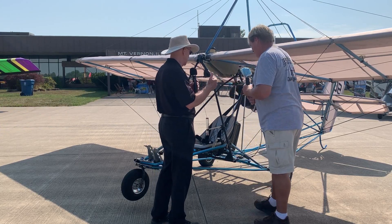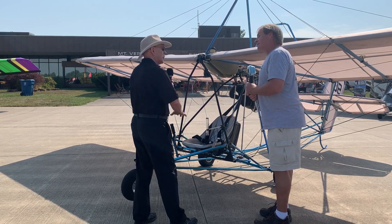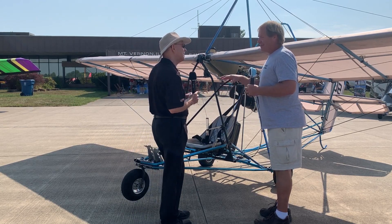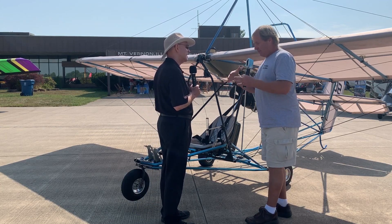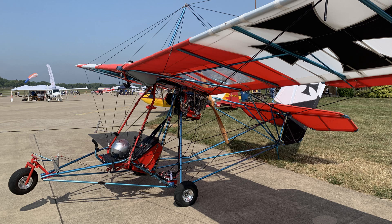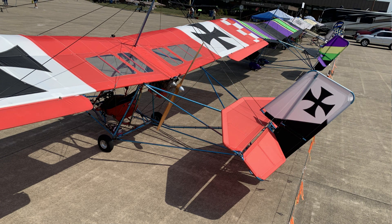I associate Mark Smith with having kind of created the steerable nose wheel. Of course, Quicksilver has it now, and they did their own job, but before there was that, he did it. Mark's tube plates — original black tube plates — the way the tubes came together, he basically welded four plates together and put a bicycle gooseneck on the front and put a wheel in it. Welded up the fork, and that was the steerable nose wheel. He had it on his trainer for I don't know how many years. And then finally, we talked him into upgrading his tube plates instead of just changing parts out as needed.